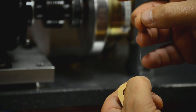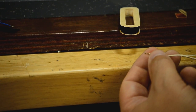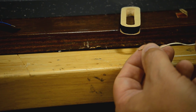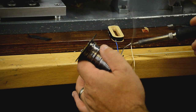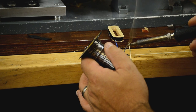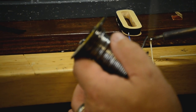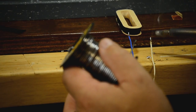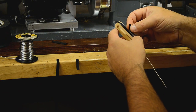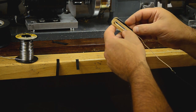You'll need to sand the enamel finish from the wire. If you make these connections to the pickup leads without doing so, you may have a cold solder joint in the future. I'll add two more small pieces to isolate the solder joints and a final wrap to pin the leads down for stress relief.